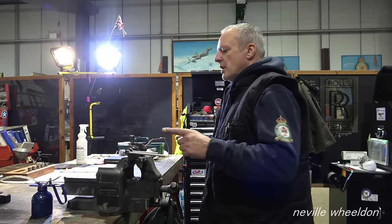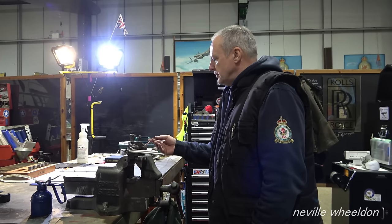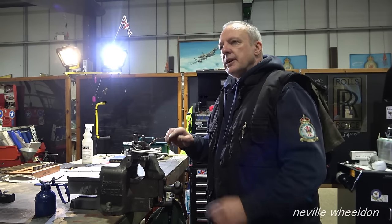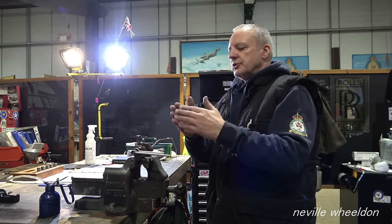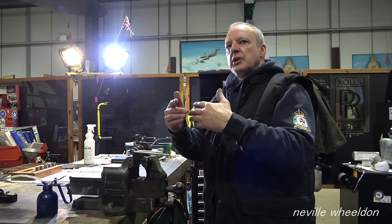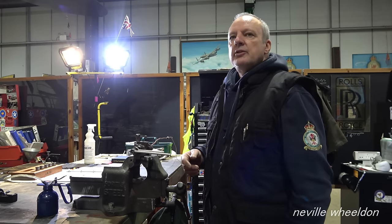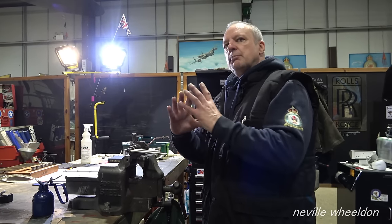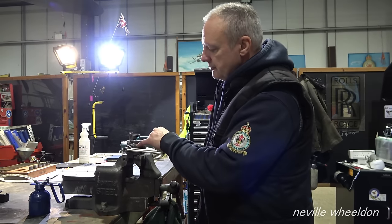So I made pre-made pipes, but then I was waiting for these little collars. The collars sit on the end, and then you flare it, so the collars are just a little bit in from the end of the pipe. When you've flared it and tighten the nut up, it pushes on that collar, which then pushes on the flare, which is just in there.